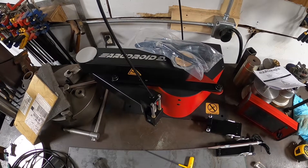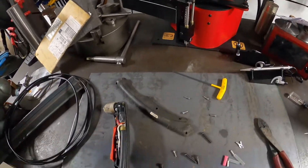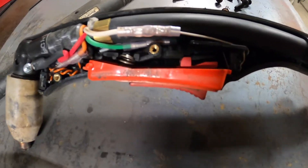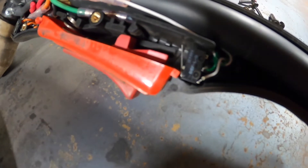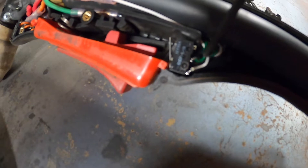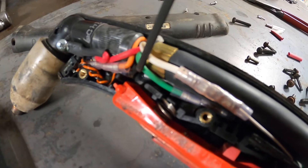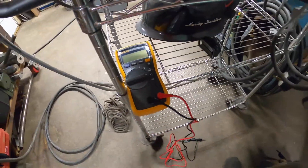I got a new toy — it's a plasma cutter robot arm from Arc Droid. Here I am trying to figure out the switching. There's a little micro switch right there with two leads, two little wires — a white and a green one — that go up to this white and green one here. Using a multimeter, I probed the plug and found the outputs and the inputs.